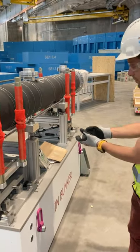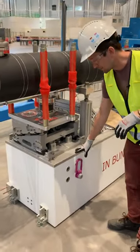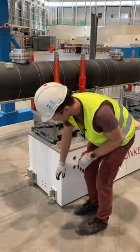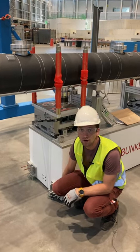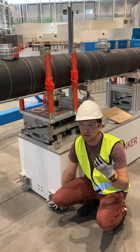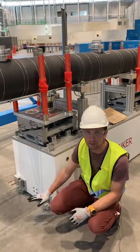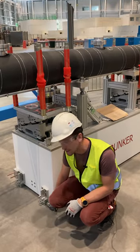The whole system combined is standing on an elevated floor — this concrete slab below — and that concrete slab is sitting on some shimmed plates. Those give us more flexibility for compensation of potential ground sinking, so in case the instrument would have to be lifted within the range of centimeters, we could just place a new shim here.